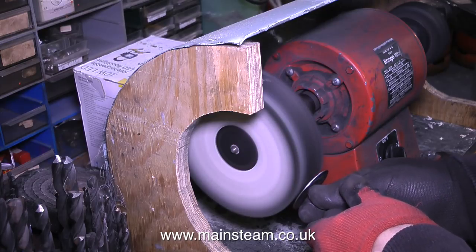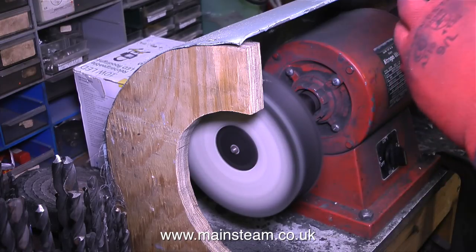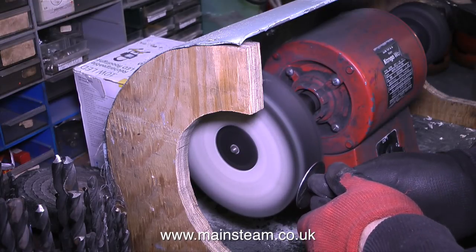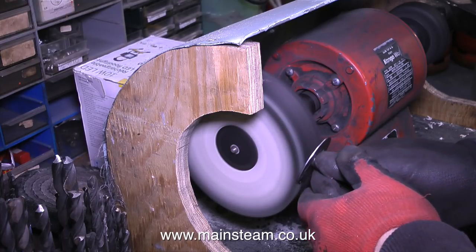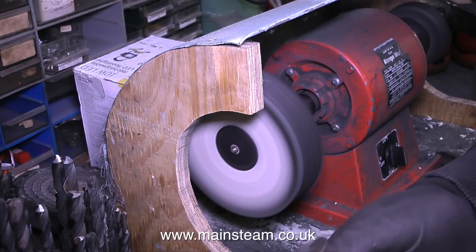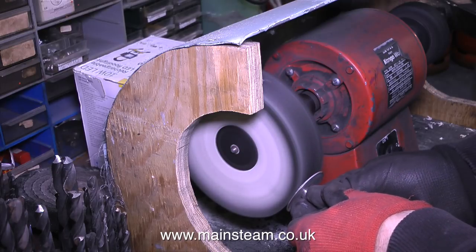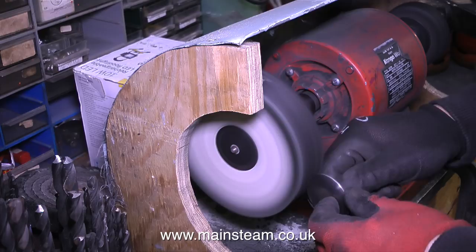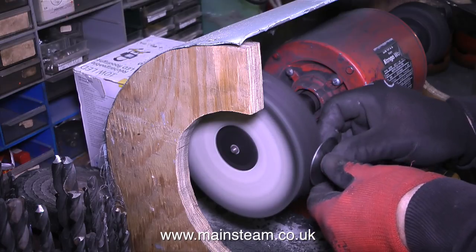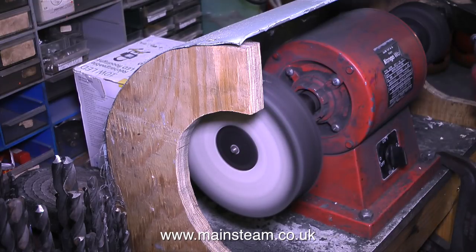When you're using a polishing spindle, it's quite important to make sure that the abrasive is applied regularly, otherwise the part really does get hot. The abrasive is in the special block that I keep touching on the wheel. This polishing spindle is double-ended — on one end is a large, soft wheel, the one I'm using at the moment, and on the other end is a harder, smaller wheel. When I apply the abrasive to the smaller wheel, it really does remove some metal. The part is now getting very hot, so it's time for a bit more abrasive on the wheel. A health and safety warning as usual: when using a machine like this, eye protection is essential. Personal protective equipment must be worn. You can see the guard on the machine, and again this is essential, because if the wheel grabs the buffer it will suddenly come your way at great speed.